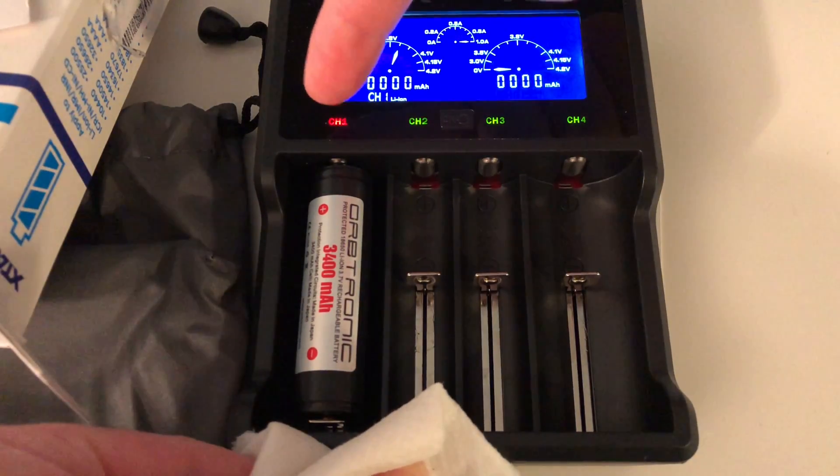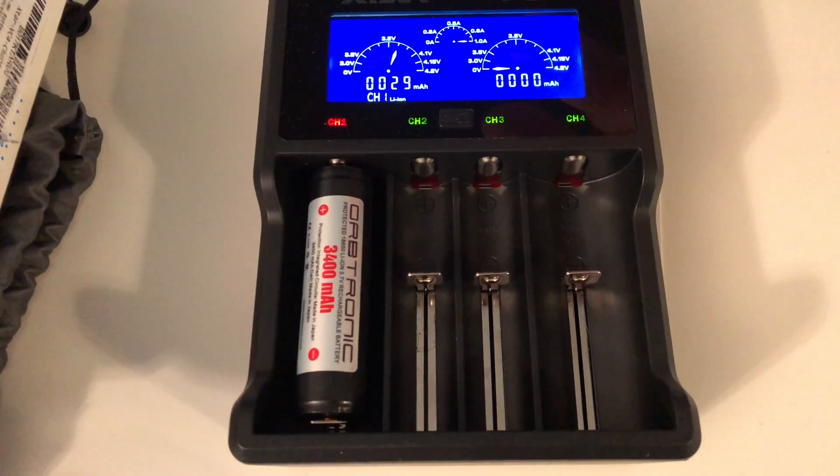As you can see, this bank turned red. What this one does is it tells you that it's charging at 1 amp, as you can see up here at the top. It is at 3.9 volts. So it's already put in 32 milliamp hours of juice — 33 at this point. So we just have to wait for it to finish charging.